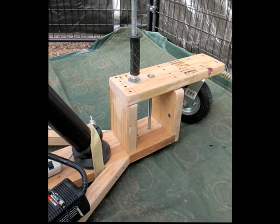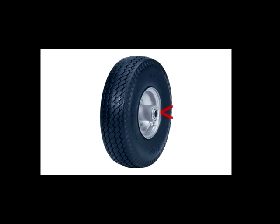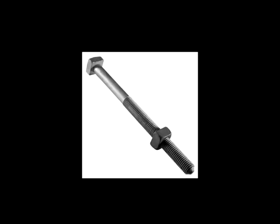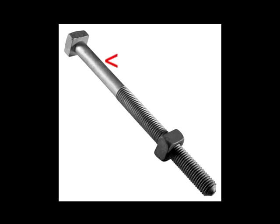The extended elevated tongue that supports the front wheel and the rear wheel supports allow the buggy to operate low to the ground. The recommended height is about three inches of clearance. This is done by setting the platform up on blocks to the desired height, marking the center of the wheel hubs on the rear wheel supports, and then drilling a hole to run the machine bolt through. A machine bolt long enough to allow the wheel to run on the smooth part of the bolt while having enough thread to bolt on both sides of the rear wheel supports should be selected.